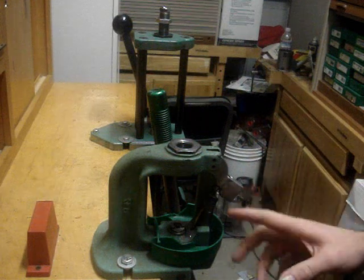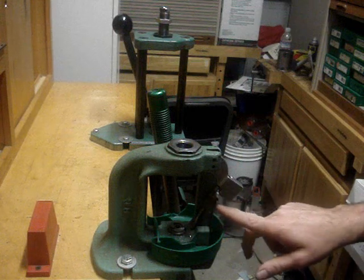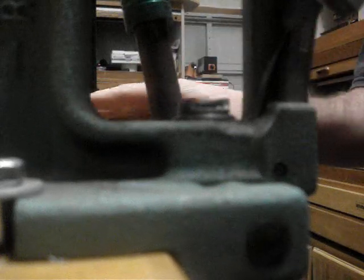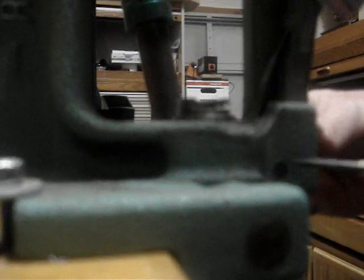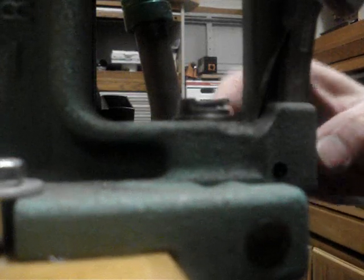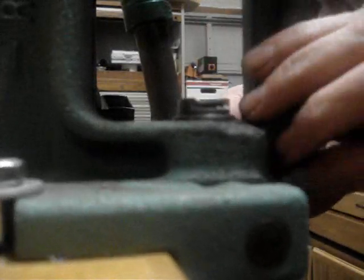The first thing I need to do is swap out my small rifle/pistol primer seater for the large one. I've removed the primer tray and you'll notice there's a pin right here — on this particular press it can go either left or right. We're going to go ahead and get started. Keep your thumb behind it because there's a leaf spring that puts tension on it and it can come right out.